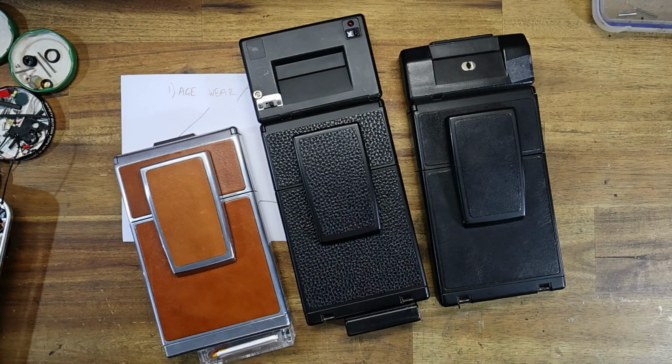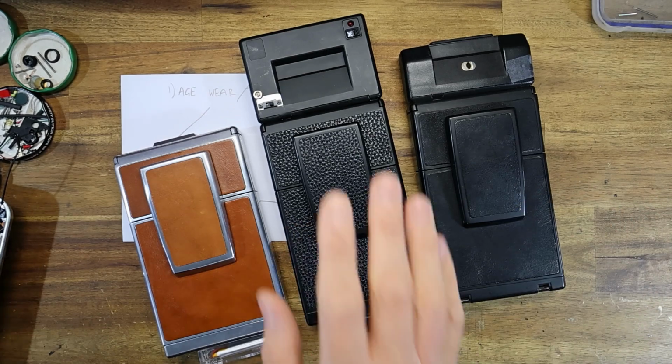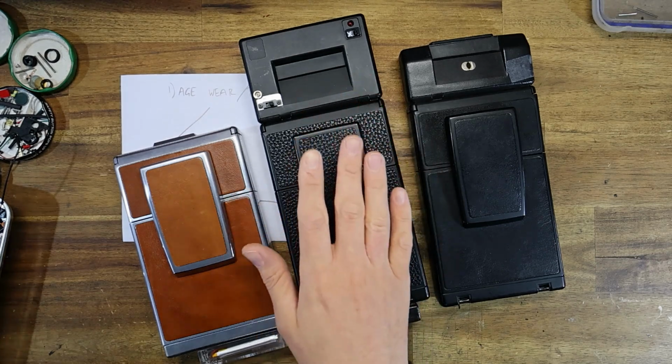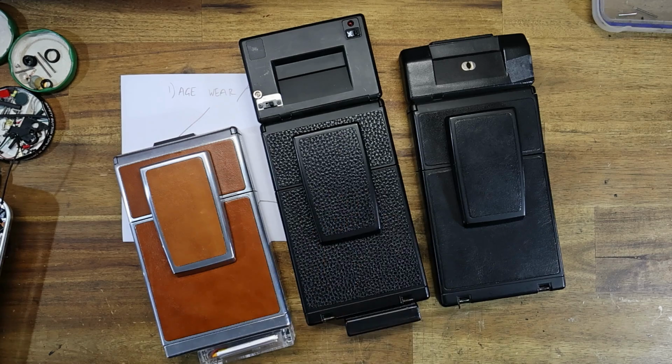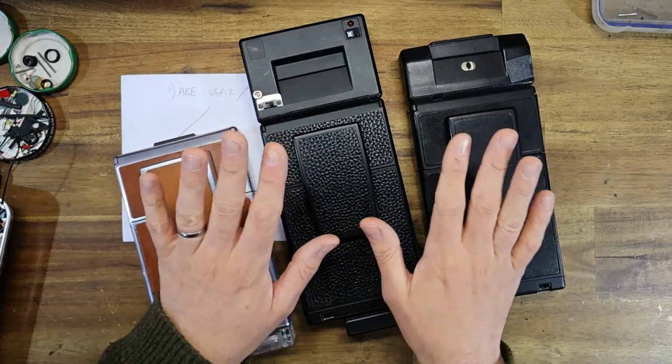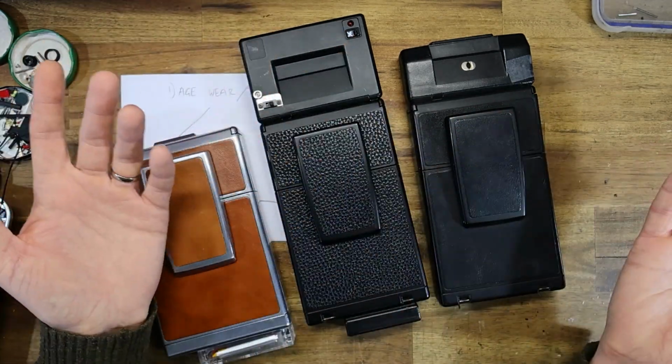They used either very cheap quality solder or very minimal amounts of solder. The joints go dry and the camera ceases to work properly because power is not getting to the autofocus motor or the shutter. There's so many things like this, and there's no perfect solution.